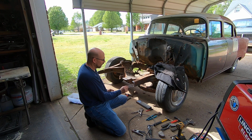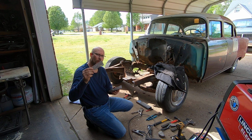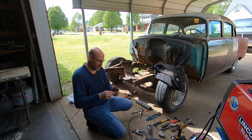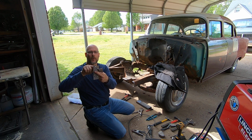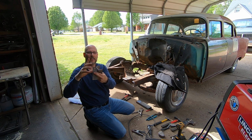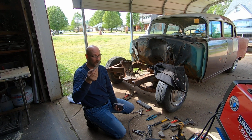There's a reinforcement plate on the back that is spot welded on, and there were only 2 of those that were still connected. The others were broken free, and this was hanging out. This was stretched apart. This is supposed to be flat here, so I had to put a relief cut in it all the way through and about 3/4 through right here, and that allowed me to fold it back down, and then I could lay this flat also and hammer it straight because it was tweaked.